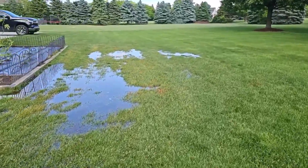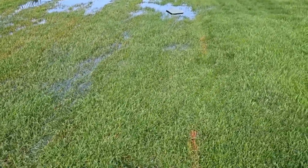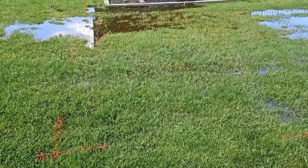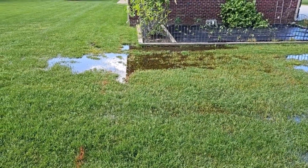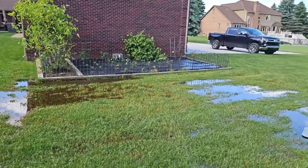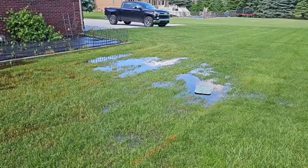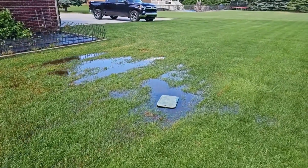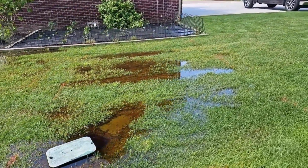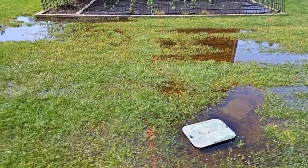When there is absolutely no way you're going to gravity drain water, you have to go to an outdoor sump pump system. We're going to use a half-horse M98 Zoller because there's a lot of water coming from all the surrounding land, and we want to make sure that when there's flood water, our pump is keeping up with it. We build an extra heavy-duty custom outdoor sump pump basin for our system. I'm going to go over that and show you all the details.